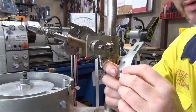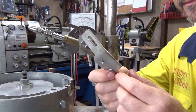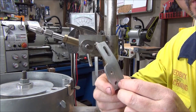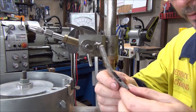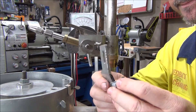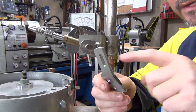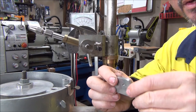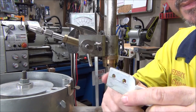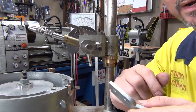I managed to get this off with a bit of manoeuvring without having to take the whole thing apart. But this is actually a piece of aluminium - it looks like steel. So that changes the ball game a bit. Because you can't weld a piece of steel to aluminium, I need to make up a whole new bracket. It doesn't need the top part with the elongated hole - just the bottom bit. So I'll go to my steel rack and find a piece of steel and make a new bracket.